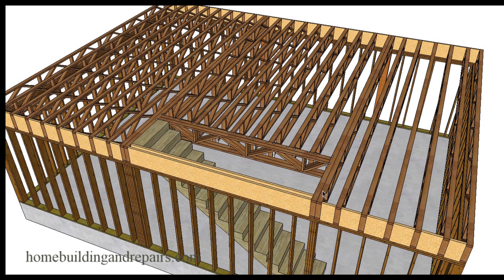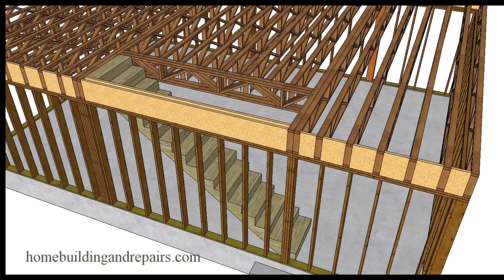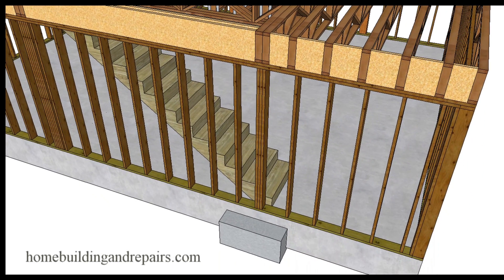We used to get these doublers and they were nailed together — they already had the truss clips on them and were one solid piece. So if you're thinking you'll just double up two trusses, that might not work; you might actually need a specifically designed doubler for something like this. I can't stress that enough — people ask me how to do something and you really do need an engineer for it.